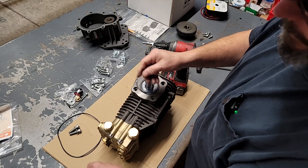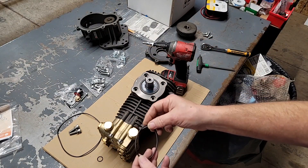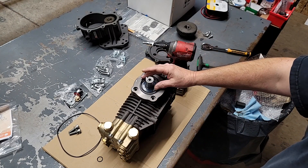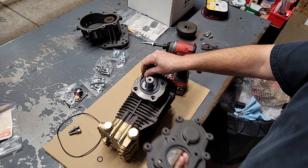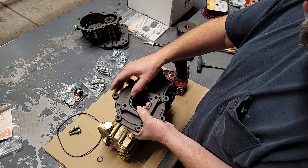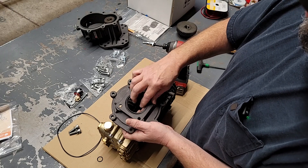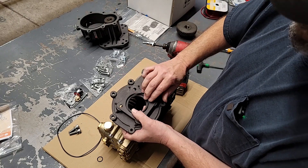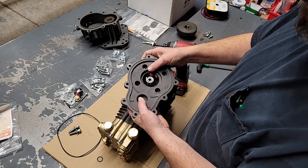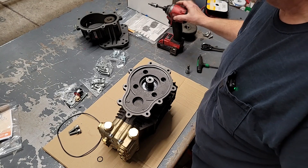You've got three O-rings in there. One of them is going to be this one right here and it is going to go right on top of this. You can ride it in there. A lot of times I'll put just a little dab of grease in here to hold it, but we're just going to turn this one over — I believe it's going to lay in there just fine. Set it right down on top, line up your four holes, and now let's find our hardware.